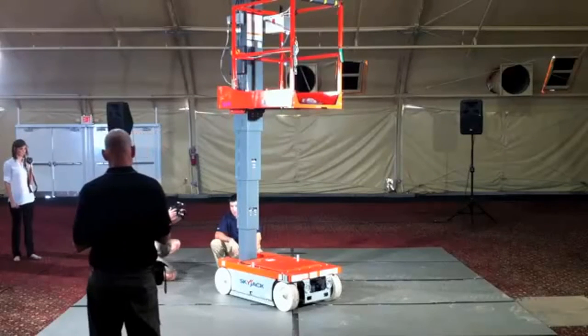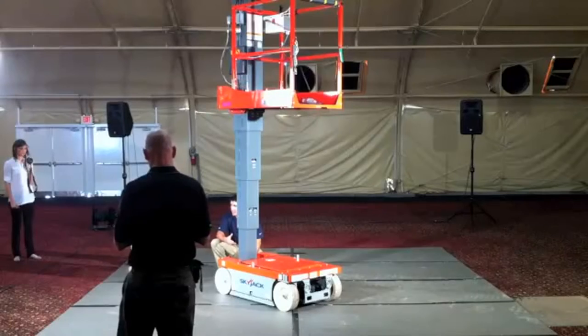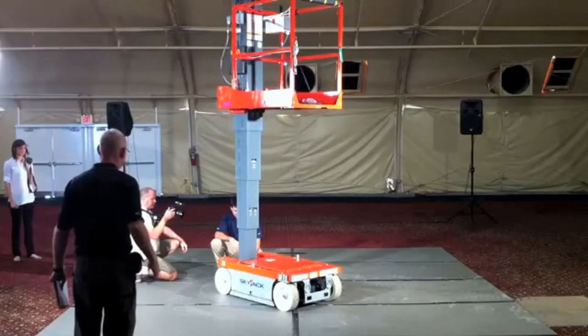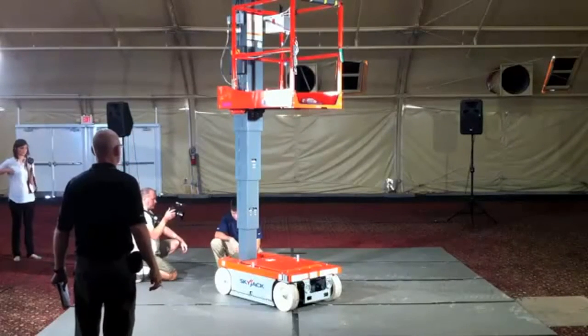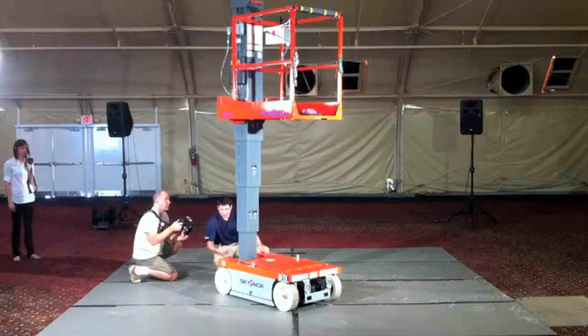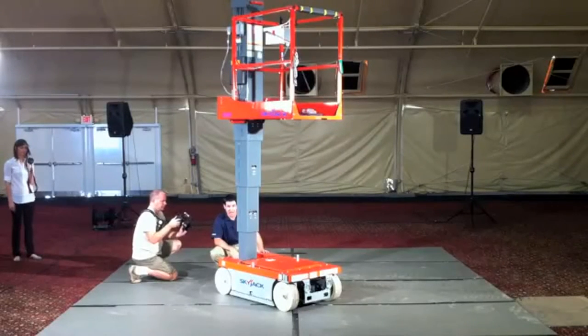Our fully analog control system utilizes relays, automotive-style relays, very similar to all of the Skyjack electric scissors that we have. So a very robust, reliable control system. We have the emergency lowering valve here. Just one pull, the valve is reattached to the cylinder, and your freewheel valve and battery disconnect, 110 to the platform, are at the back as well.